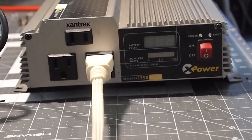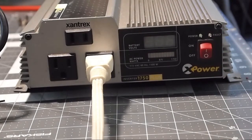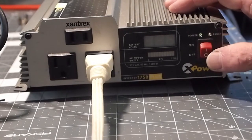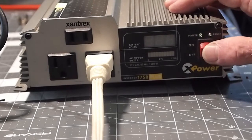inverter down. And so I noticed that first when I would be using the inverter in my van and I would turn something on to cook and it would work for about a minute while the batteries were fully charged. Then the sag would bring them down to the point where the inverter would shut off and I would have to run the motor, which would then be kicking in the alternator, which helped bring the inverter up.